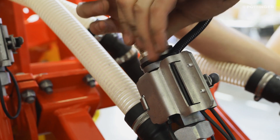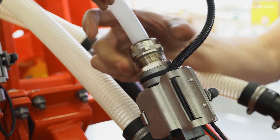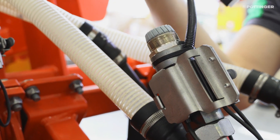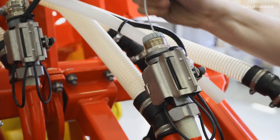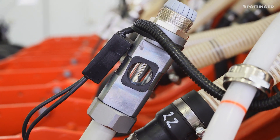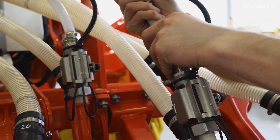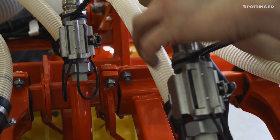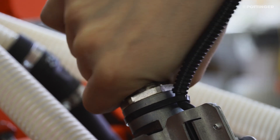The separation sensors in front of the seed coulter monitor the seed transport and simultaneously measure the seed distribution in the seed slot. We recommend regular cleaning of the sensor tubes using the tube cleaning brush supplied. After cleaning, we install the tubes as they were before, meaning that the coulter pipe must be slotted on right up to the limit stop and the fitting tightened.